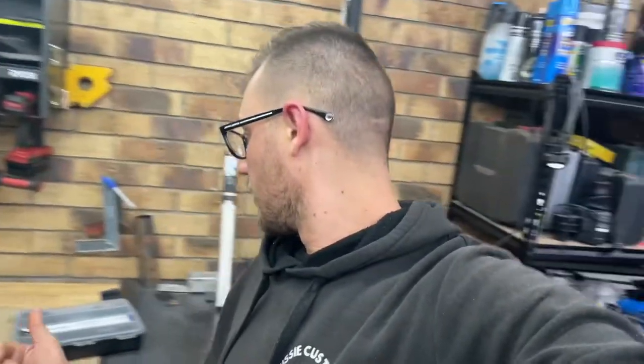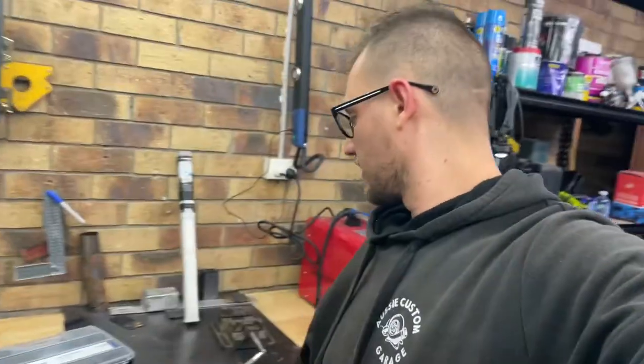It's heaps easier to look on Google for what amperage you need for what size mild steel or aluminium you're welding. I generally just keep it between 90 and 135 amps depending on what I'm welding - obviously the thinner the metal, the less amperage you want. That all comes with feel of what the machine's doing. Also, set the regulator around 10 to 15 CFH - that seems to be fine for me.